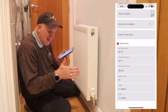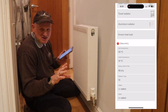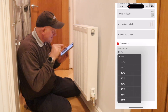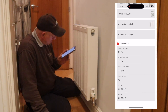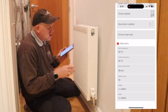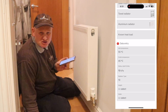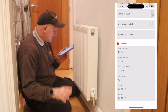Realistically you'll get between 10 and 20 degrees difference on a condensing boiler, unless you've completely redesigned the system — installed new pipework and brand new radiators, not just swapped the boiler. We'll give it a 10 degree difference, so we put the outlet at 45 rather than 35. Our delta P is our pump setting. If you go over 20 kilopascals you'll get noise in the radiator, so it won't let you go past that anyway. It comes set at 10 as default, so we'll leave it at 10.